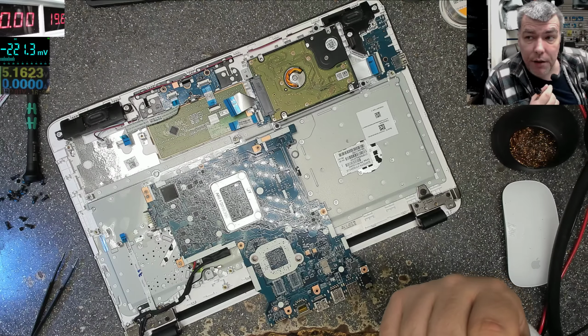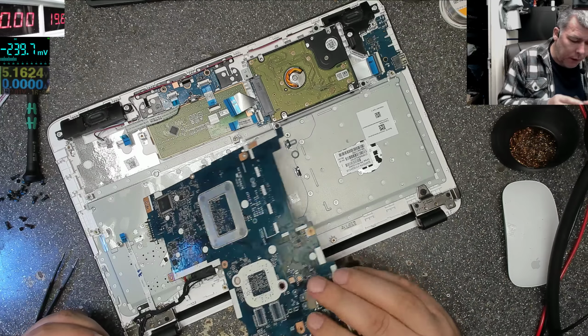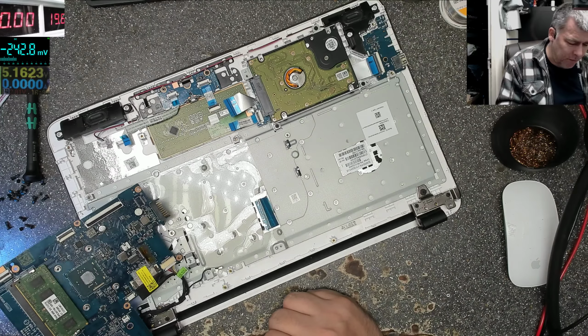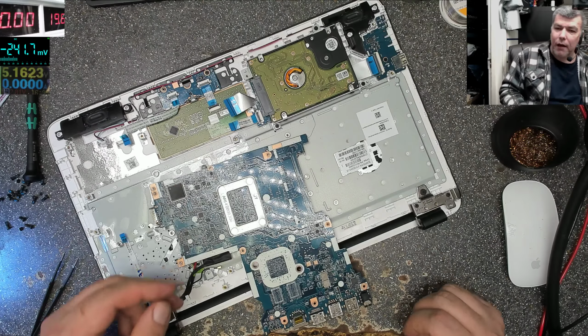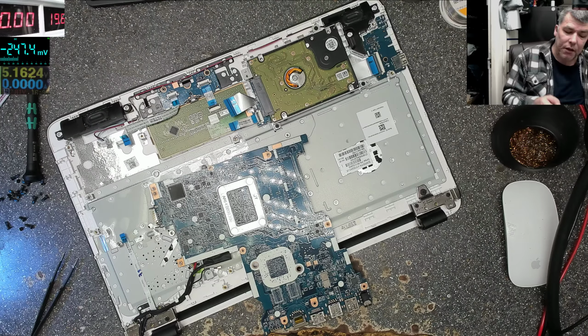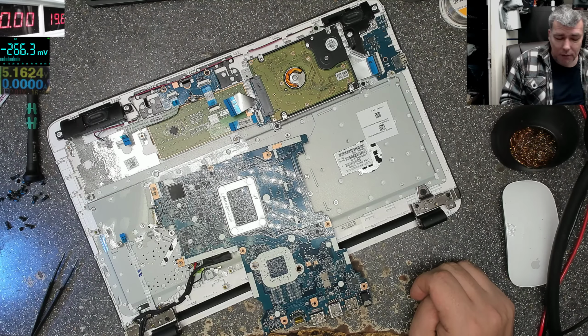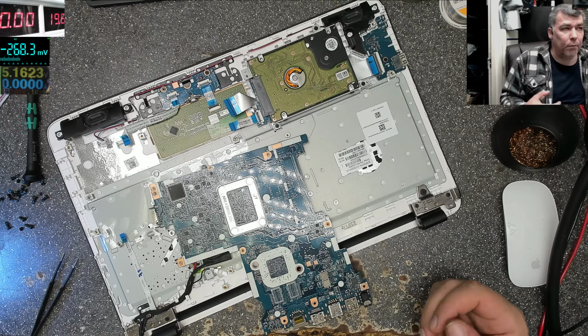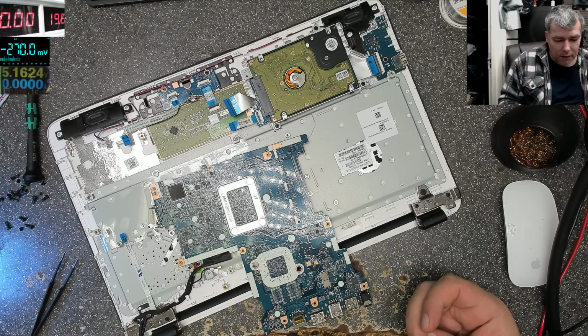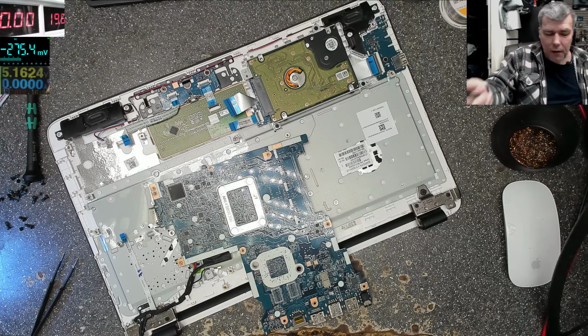But before checking what the reason is, I want to see if the motherboard is good. Because if you have a dead super I/O, you can't really fix it. This comes with the BIOS inside. This chip is programmed before, so you cannot replace it with a blank chip. You have to replace it with a chip from the same motherboard, or that's it. This is the only option for us, just to get a programmer and program it properly. It's time consuming, and we are not doing this. That's the shop policy, so any job should be done quickly.